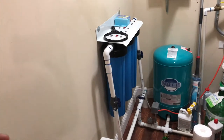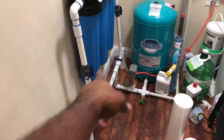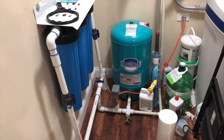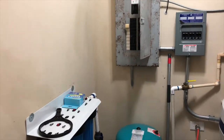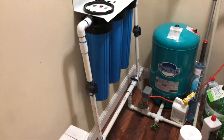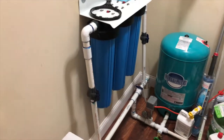The very first thing we need to do — I've already done it — is take the pressure off these lines. Make sure the pressure is off in your water system and make sure the water is turned off. I already turned it off. I flipped the breaker for the pump that runs the well, and I got the faucet open. All the taps are open so there's no water coming through, not even a drip.